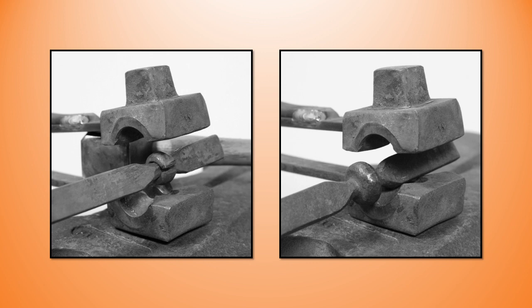Here's my finished tooling in action. You might find it necessary to run a round file between the two to get the correct size right at the neck. I would ask you to do a couple of welds first and see where the tools are biting into your flat bar before you make that decision. Once you've got your tools dialed in, consider case hardening them for longevity. The second bar you can see is a lever opening bar — it is welded at that point only, not to the other end of the staple, otherwise it will deform the staple. It really helps when getting the collar material out. I use my hammer to keep the two tools apart going into the weld, but getting it out I need the lever, and it saves me having to put my hand near a very hot tool. This marks the end of this particular session — the next session should be on the welded collar itself. Thanks for watching, I'll see you next time.